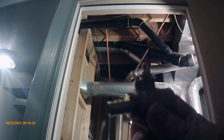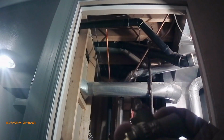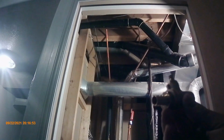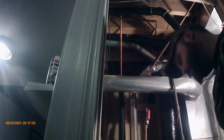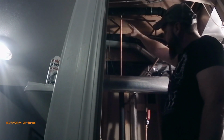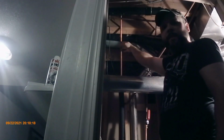So here, the valves. Sorry for the noise, that's just my furnace kicking on. I took the handles off. There we go, there's the handle. This will be placed back on there. Took it off so I can wrap it with a damp cloth, because as I'm putting heat to it, I do not want to damage the nylon ball that's inside. So by shutting off the main line, opening up all the taps, the water is draining back through the system down in the basement here. I got the bathroom sink on in the basement. So I'm just letting that be for a while, and then I'll come in here and I'll cut this.